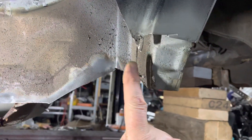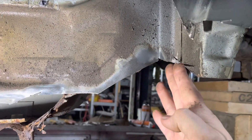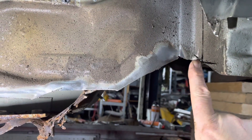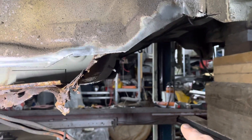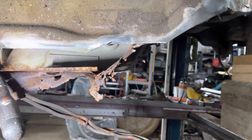At the corner I'll also make this going straight down and then spot weld a corner metal, also in 1.2 mm. This piece will go down to the corner and we'll have a really solid structure. See you.